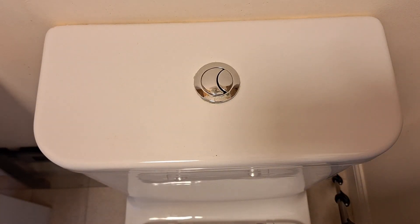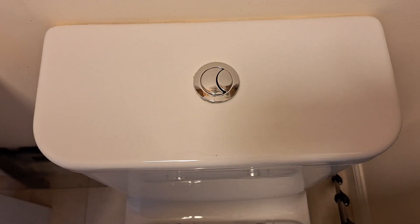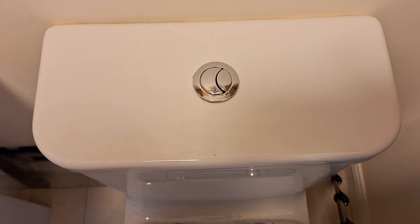Today I'm going to show you how to sort a dripping toilet. This is where the water trickles down like a little waterfall, and this is usually caused by possibly two things: the outlet valve, or a combination of the outlet valve and the inlet valve washer.